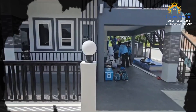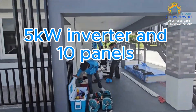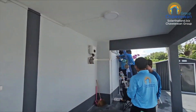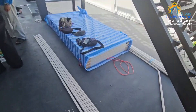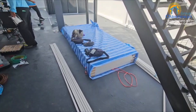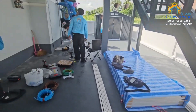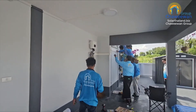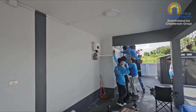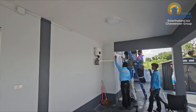Today we are finishing an installation — a small on-grid 5 kilowatt inverter. You can see the white inverter up there. We have 10 Trina 620-watt panels, so this system will have 6,200 watts. That's a little more than the inverter size, which is called oversizing — and that's the perfect way to do it, because you have losses in cables and losses in the morning, in clouds, and in the afternoon.